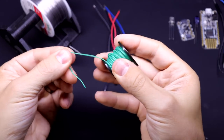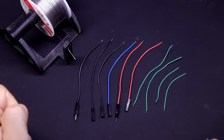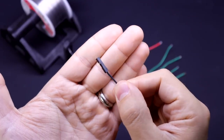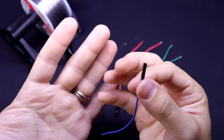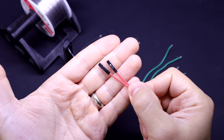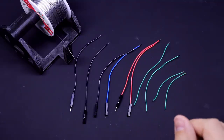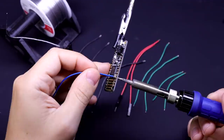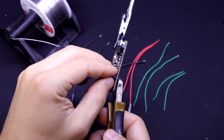Next, prepare a few pieces of wire — do a couple of 3 inch or so pieces and a couple 2 inch pieces. I'm going to be using the black ones for ground, with one male side and two female sides. I'm using the blue female side for the input and output pin on the feather board — that'll be used for both the infrared receiver and the LED. A male and female red one for power. The longer green wires will go to the gesture sensor, and the shorter ones will go to the power switch. The way I like to attach wires like this is to tin the pin holes by adding a little bit of solder to them, then heat it up from one side and push the wire through. If it pokes through a little bit, you may want to snip off the excess.